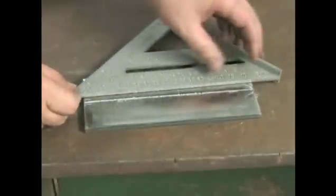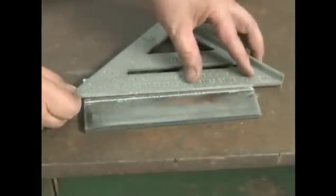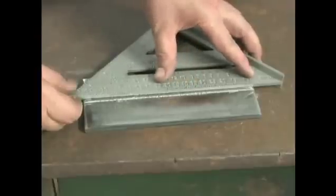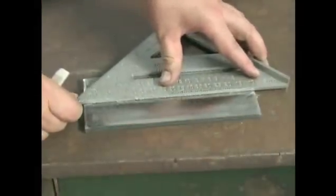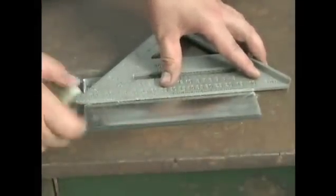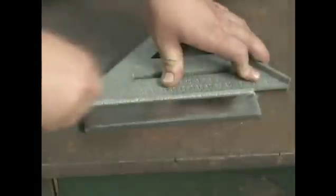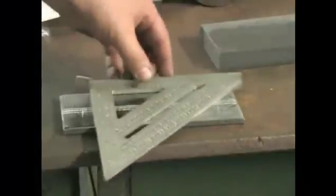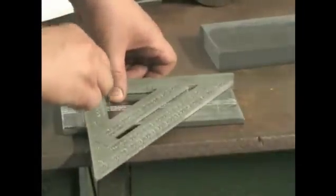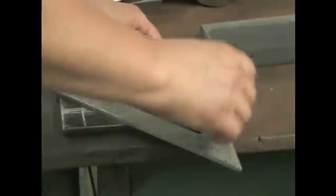Take the quarter inch bar with the ground side up. Mark a line down the center of the 8 inch length. From the center line, draw one parallel line on either side, one eighth of an inch. This will give us a quarter inch root opening, which is needed for proper fit up. Now draw a line one inch down from the bottom and one inch from the top, which will give us six inches in between.